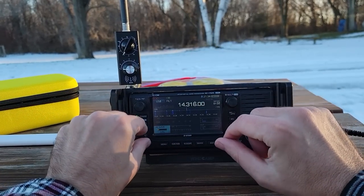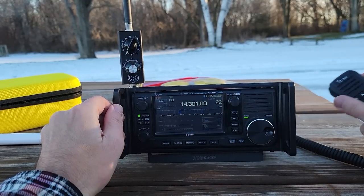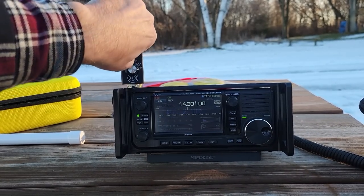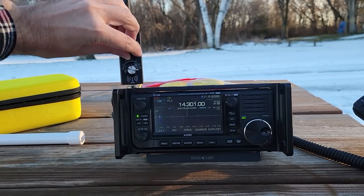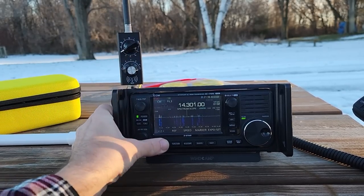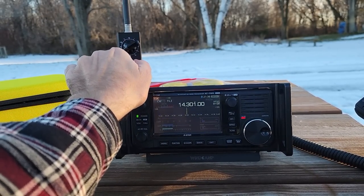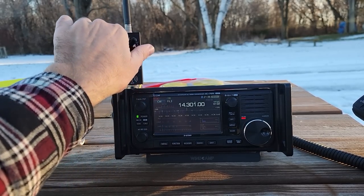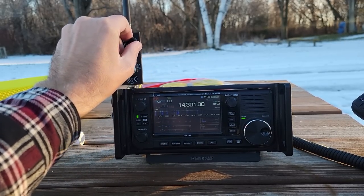Let's go find a clear frequency and change it over to CW mode. We're at two to one. You can see the waterfall come up as I get closer to resonance — as I tune the inductor, the waterfall signal gets stronger and stronger. Somewhere there is the best. Going into the meter, we're off the charts, but I can tune the capacitor down to about 2.5, then two. So adding that one ground radial didn't help much. Let's add more ground radials.